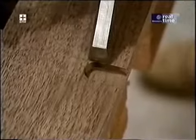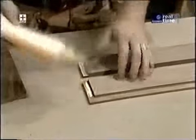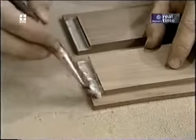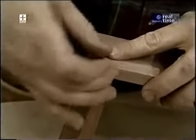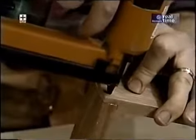I'll just guide it against the edge, then use a nice sharp chisel to square up the back corners. Now it's time for a little assembly. I'll put some glue on those dados at the top and bottom of the sides, spread it out with a brush, and put the cross pieces in. I want to make sure I hold the cross piece flush on the front side, then use my brad nailer with some three-quarter inch brads to fasten it.